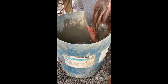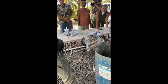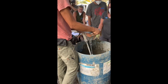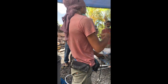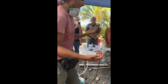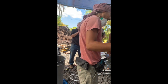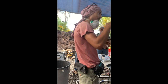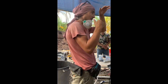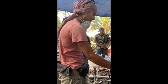So basically if you find any lumps, just stir it up a little bit more and then get on with adding foam. You also want to keep the mixer all the way down in the bottom of the barrel, because that's where the heaviest cement is. You're always incorporating the heaviest cement with the foam. It's good to move it around the entire time to get it all mixed better. If you don't mix the aircrete well enough, the bottom ends up being really dense and the top really light — then the top collapses and the bottom is hard as a rock.